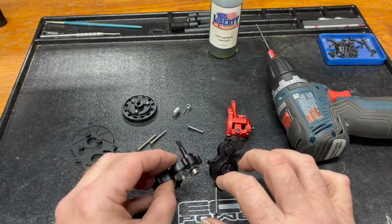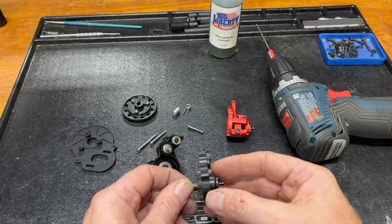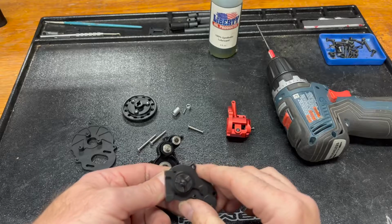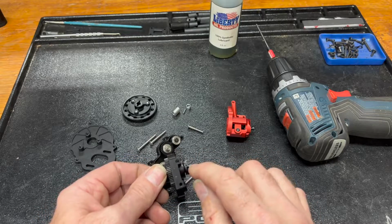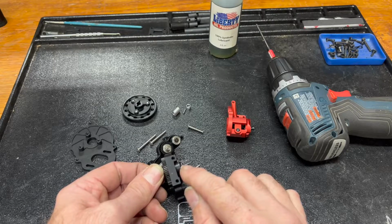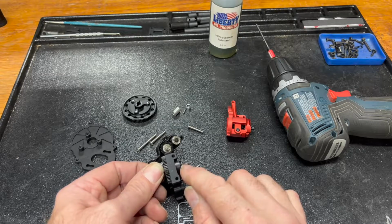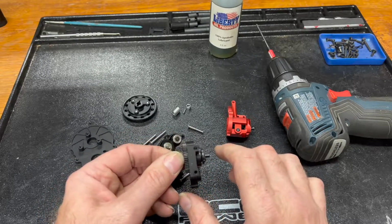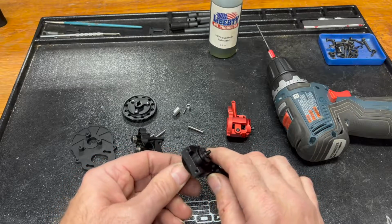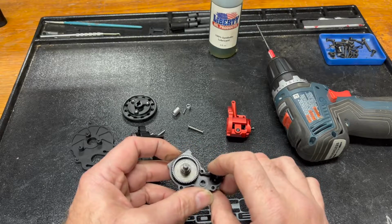after I do the necessary work on this shaft, which, kindly enough, I do have to remove the dig locker. My other one didn't even have the set screw because it's keyed, so it didn't matter. This one is set screwed on there, and it's a wee babby. I think it's even smaller than 1.3 millimeter. I do think I found a suitable screw for the other one, so I must have an Allen wrench set or driver that small around here somewhere. But for me, I have to get that part off. For everyone else, you don't. You just glob a bunch of grease in there and slap it back together.